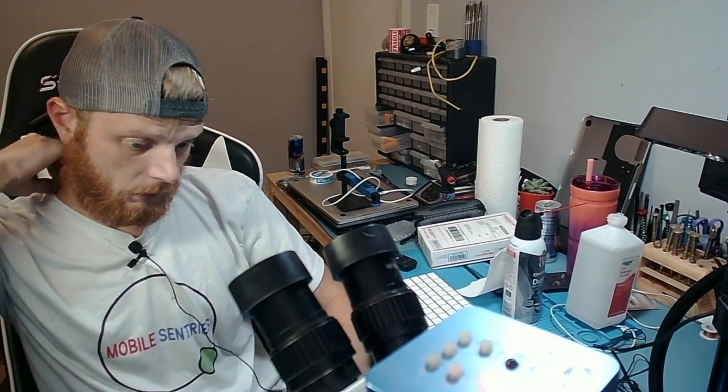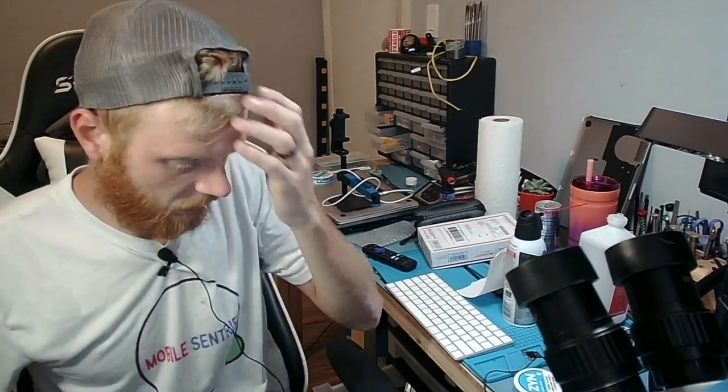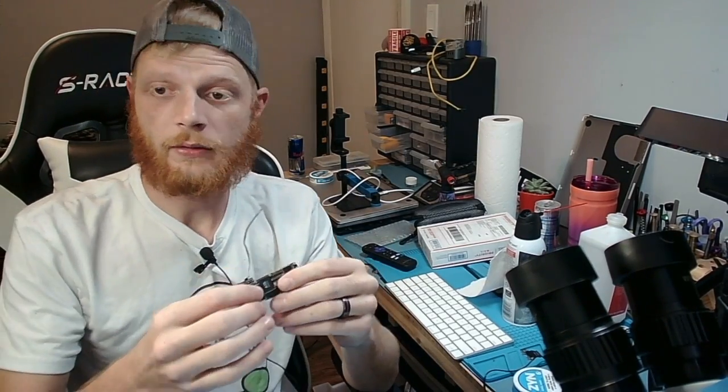Alright guys, so the board is cool. So now the next step, like I was saying, was to check to see if there are any main shorts or shorts at all on the board. So what we're going to do is connect it to a DC power supply. I'm not going to have it connected to my DC power supply for the whole boot process because, like I mentioned, I bought the iPower and it broke, and now for some reason it loops the phone instead of actually booting it. I'll tell you, that was a fun day when I realized that it was not the phone, it was the equipment that I was using. I was not happy because I spent a good amount of time diagnosing that.